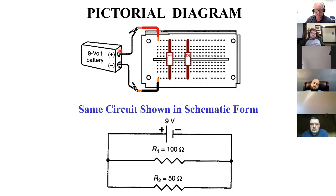So the electricity isn't flowing through here? Through where? I wrote it on your screen. Oh, right here. Is it flowing through there at all? Or is that just representative that there's a resistor on both sides here? It's absolutely flowing through there. This voltage is trying to force electrons. If it can find a path, it will. If it's open circuit, it can't. But it gets to this point, and it's like, here's a path. And yeah, there's some resistance, so I can only push so much through here, but I can get some through and back. And also, hey, here's a path. I can shove some down this way, too.